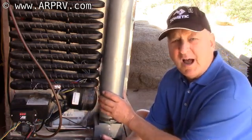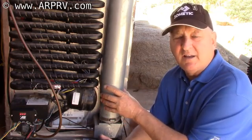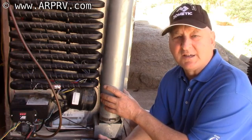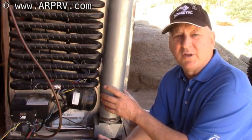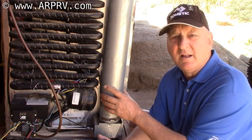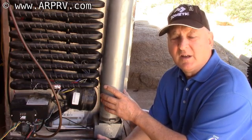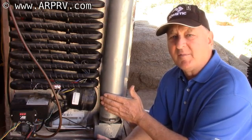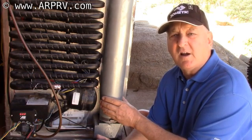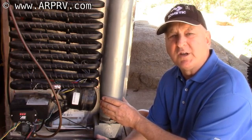This is your boiler housing right here — it's sheet metal that goes around insulation inside. It works no differently than insulation in your house, which keeps the inside at a constant 72°F regardless of outside temperature. The boiler housing does the same thing: it keeps the boiler at a constant temperature of around 350°F, which is the temperature at which ammonia boils. Your refrigerator will not work if the ammonia doesn't boil.